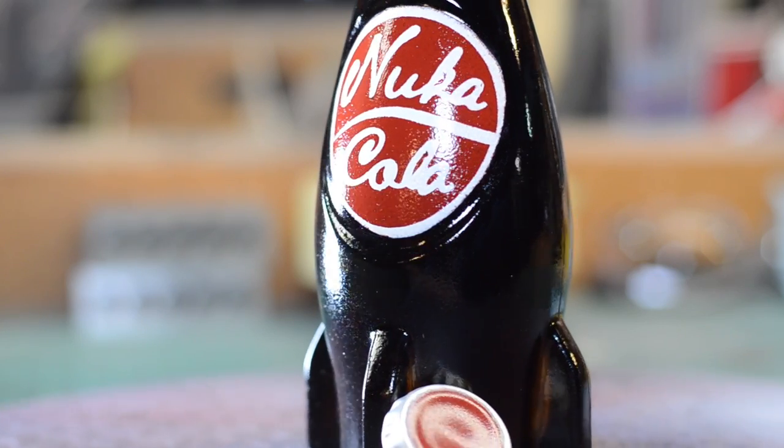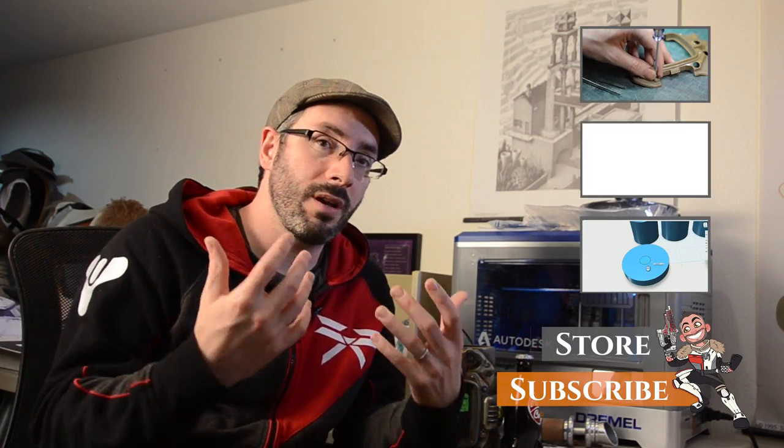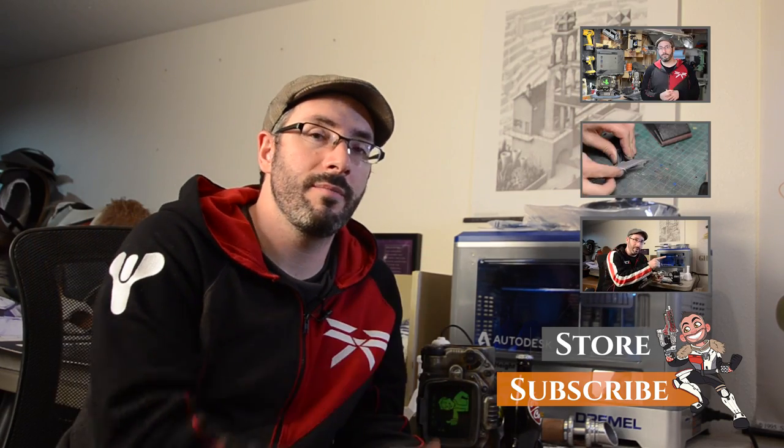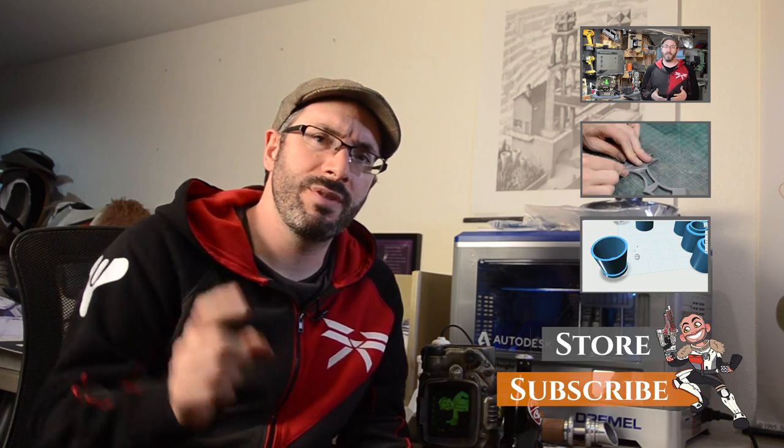I'm super happy with how this turned out. It looks like real glass, which is really cool. Now we have that mold, so we can make more of these. If you hold it up to the light, you can actually see light going through the brown thin parts like it's real glass. I can see some spots where the resin's a little thin — maybe should have gone with four layers. If you're following along at home, I highly recommend, even if you don't have a 3D printer, trying to 3D model this sort of thing — it's a really cool skill set. Also, if you're new to mold making, maybe try something smaller and get yourself some trial-sized kits of your silicone and resin. Trial-sized kits are much cheaper than getting gallons, and if you have a smaller project, it's a lot less expensive when you screw up. Thanks for watching — subscribe if you haven't already, and I'll see you on the next episode of Prop 3D.